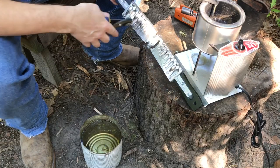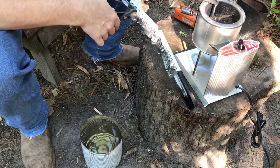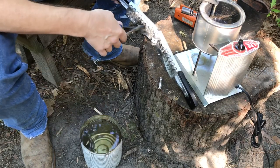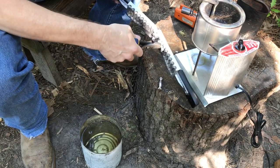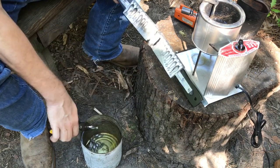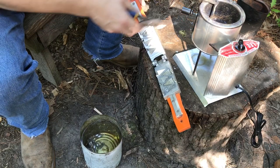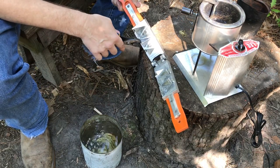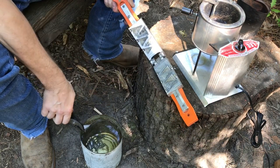I've got a coffee can with water I'll be dropping the sinkers into just to cool them off so I can handle them a little faster. You have to be really careful though — after you cut off the sprues, you don't want to drop any water back into the pot as you're putting the sprues back in. If you do drop any water into the pot it'll create a little explosion as the water returns to steam, and hot lead will come out.